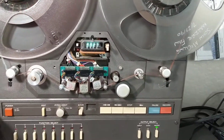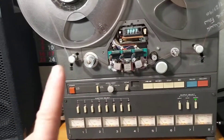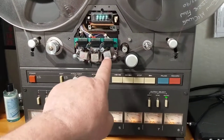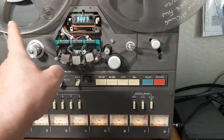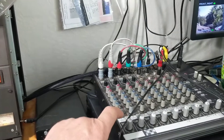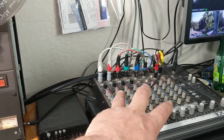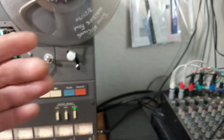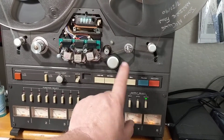Let's demonstrate now — this is a 30 inches per second quarter-inch tape. What is happening is that half of the channels of the track machine play this two-channel master recording, and they go to channels one, two, three, and four. It can be mixed on the mixing board and the signal can be a down-mix, like a stereo signal, to the computer.